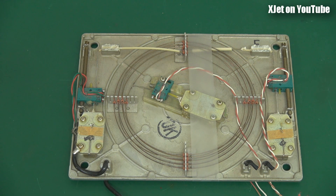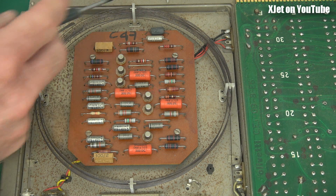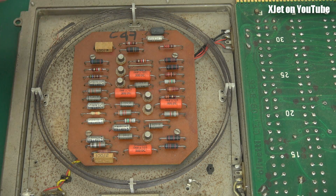I've got another one here. Put that on the bench and have a look at that as well. Obviously this one is quite a bit larger — it's got more turns and the diameter is larger, so it's going to have a much larger storage capacity. But again, we have these little nickel strips here which run across to the wire and basically put a twist in the wire. The twist travels round and round and round and ends up over here. This one doesn't seem to have a separate sense tap on the coil, so when the data reaches the end it's amplified and reprocessed and fed back into the system.